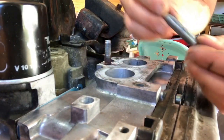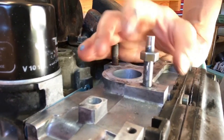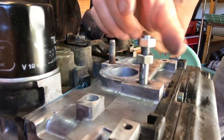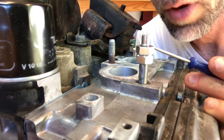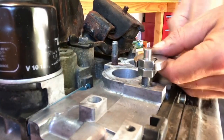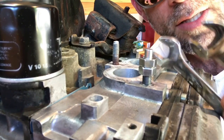Once you start threading in the stud, put your first nut down far enough so you have room for the second nut, then put the second nut down. Once the second nut has bound with the bottom nut, go ahead and thread the stud down. Remember: when using the double nut method to thread down a stud, you screw the top nut down. If you're pulling the stud out, you unscrew the bottom nut up. Once the stud has gone all the way down and bottomed out, use two open-end wrenches to break the two nuts apart and unscrew them off the stud.